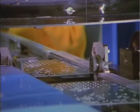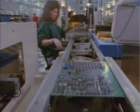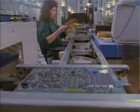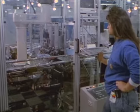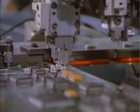The circuit board is again subjected to infrared reflow to harden the glue and then flips back to the top side. The other way of placing parts on the board is the through-hole assembly process. Here, electronic components with wire leads are inserted through holes in the circuit board.